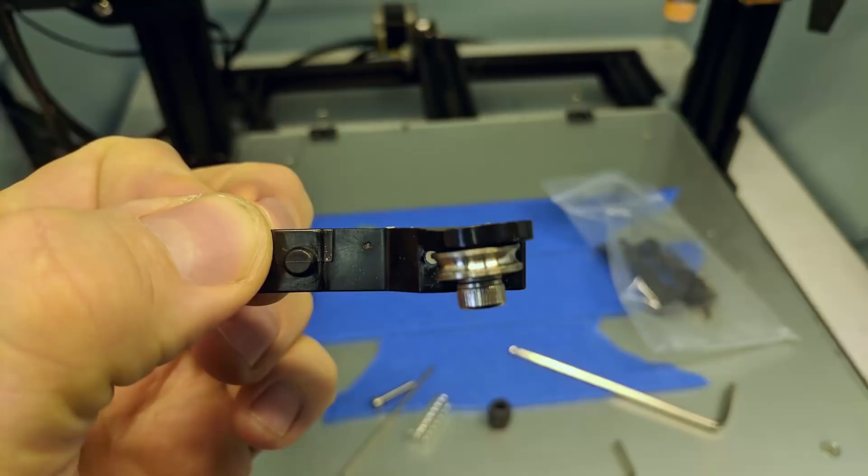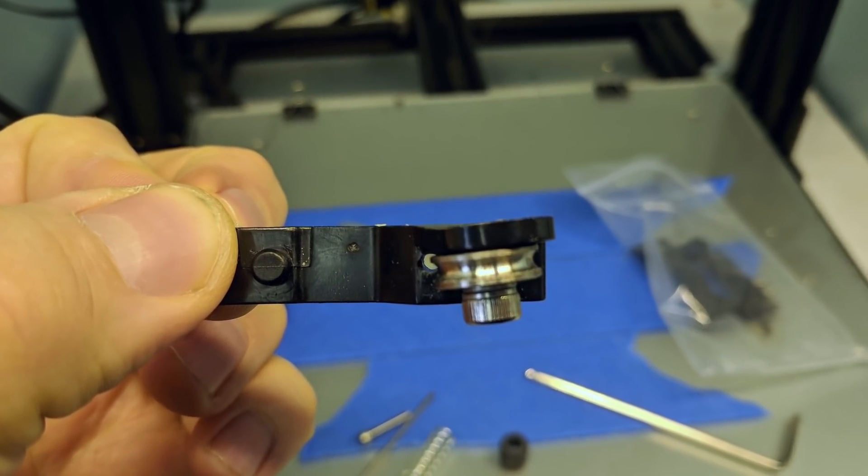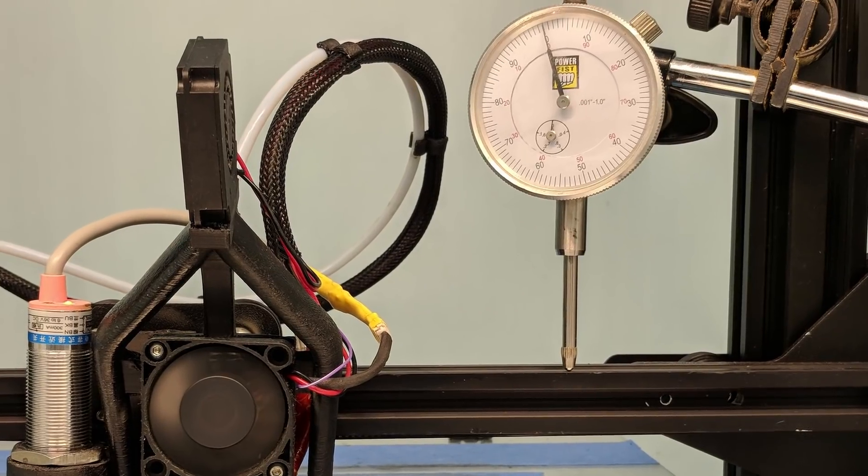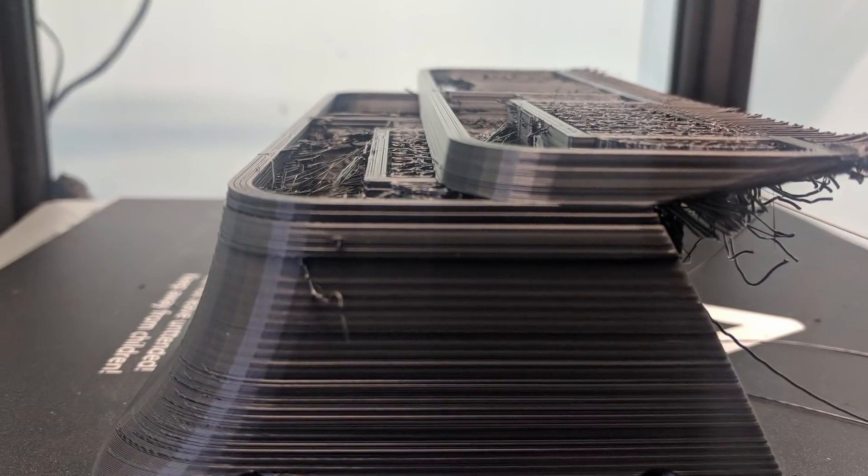There are many causes for this. Some of the original components on the printer were made of plastic and were spring-loaded, and inside the hot chamber they started deforming with the heat — so I made and replaced those parts with aluminum. Then layer height became suspect because of the number of steps of the stepper motor multiplied by the pitch of the lead screw, which needed to be equally divisible by the layer height. So I fought with jammed nozzles, extrusion multipliers, and retraction settings — and then 22 hours later, failed print.